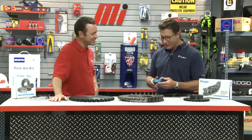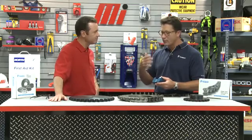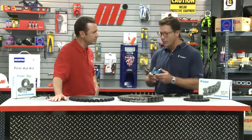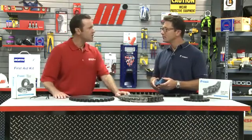Are there exceptions to the availability of this technology? There are. This technology is limited to sprockets with pitch sizes greater than 100 for roller chain. With engineered chain, it's 2-inch pitch and greater — so it wouldn't work on a 10-speed bike. Implementing this type of technology makes sense for businesses that rely on capital equipment which drives the livelihood of the business. In the event that you have capital equipment that cannot afford downtime, you would want to put this in. Easy to determine — you can just look at it and see it.